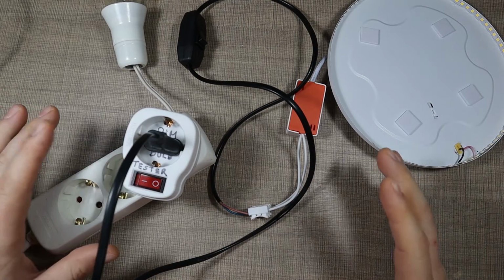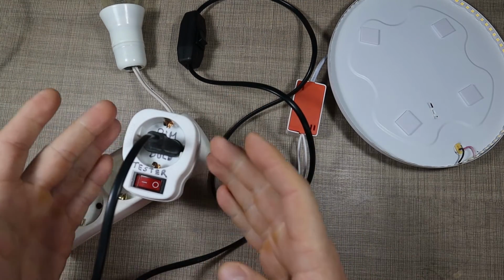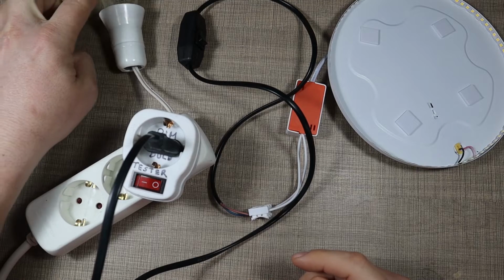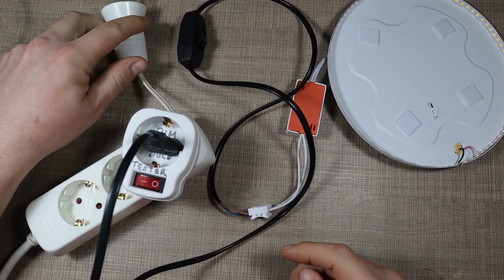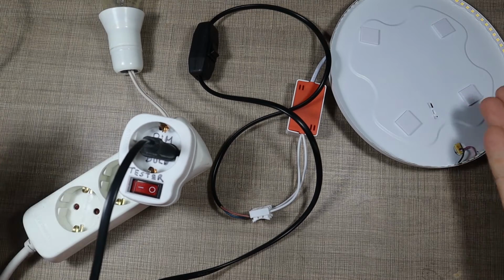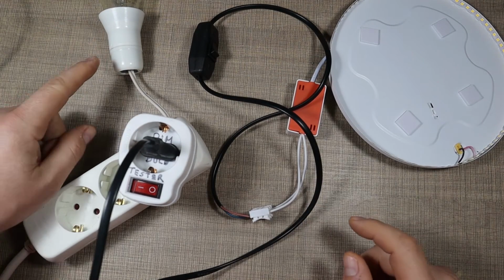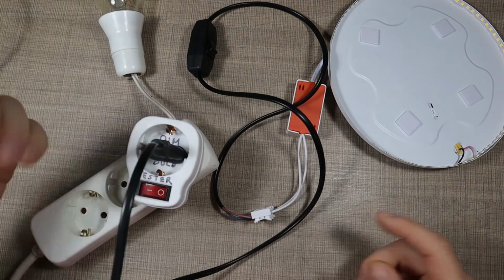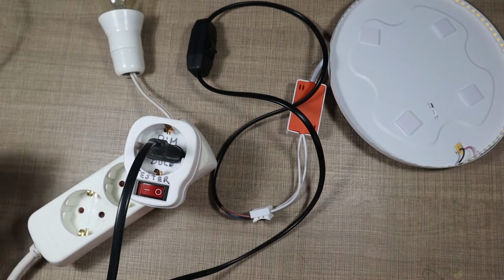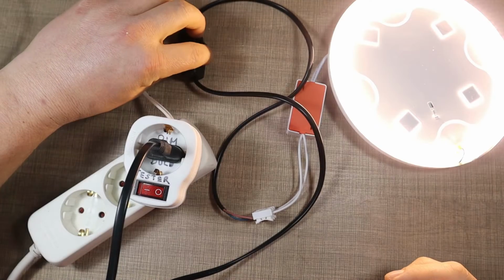Now to test out the panel, I'm gonna use my dim bulb tester. Basically this is a device that adds this light bulb, 100-watt light bulb in series with the load, so even if the load is short-circuited, it won't go bang. So you have a full video on it on my channel that you can see up here. And now all of this is connected. Let's see if we turn on the light. Let's see if it's gonna work.